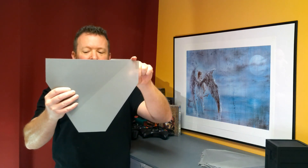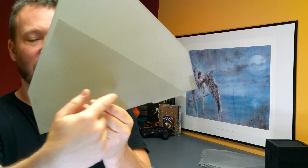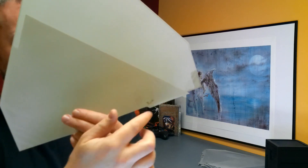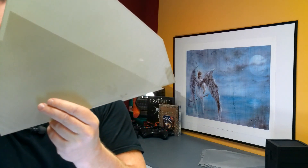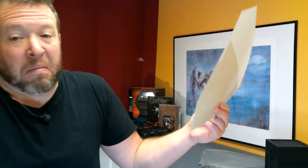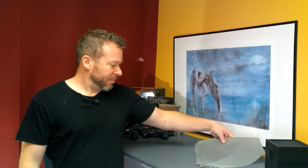Now let's get to the weirdest part. I would call that a layer shift. If you turn it around, you can see the second layer printed, and then it literally shifted over by three-eighths of an inch, and then it sticks out on the bottom. Also, why did it print the first layer and then this little bit in the corner, and then print the rest? No idea. I don't really know where the layer shift came from. I assumed it's because I had to put the printer on its side and the gantry moved on its own, and I didn't do a new calibration before I started the print. I also thought auto-home would take care of that because it's not vertical — it's the horizontal direction. But yeah, it got really bad.